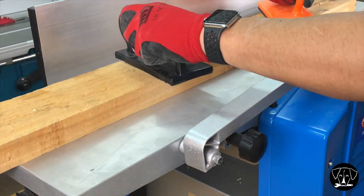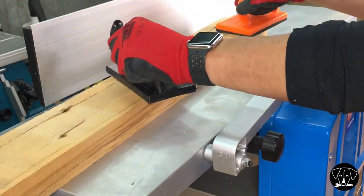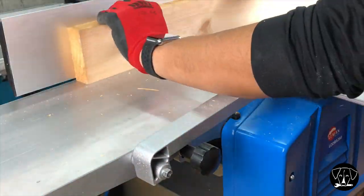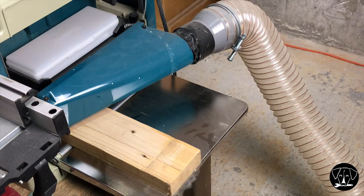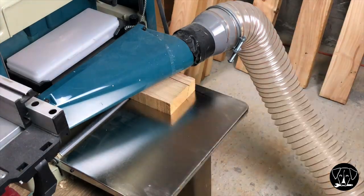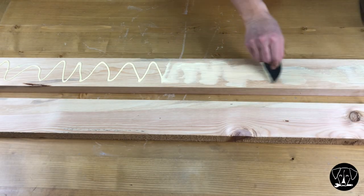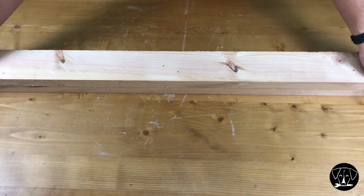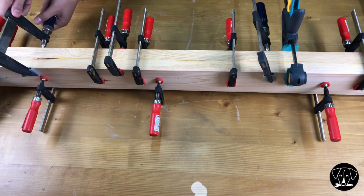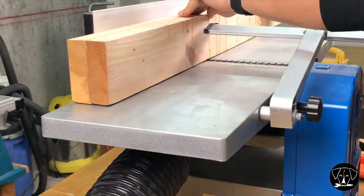The pallet wood was used for almost a decade and needed to be straightened and flattened again. To make the planks pretty again, I'm going to pass each of them through the jointer to have at least one edge and one face flat and straight. Then a quick pass through the planer to work on the other face of my planks. I'm gluing two of them together because I need my planks to be 1.5 times wider than they are thick. If my planks are 9 cm wide, then I need them to be 6 cm thick. Another quick pass through the jointer to remove the excess glue.